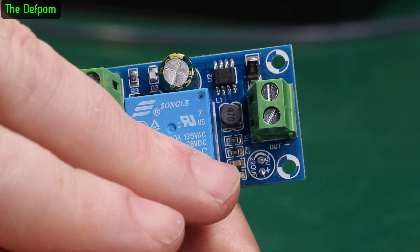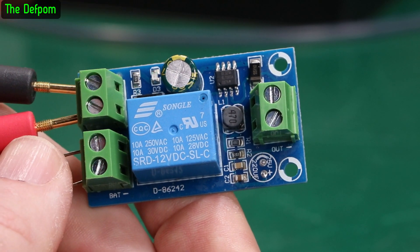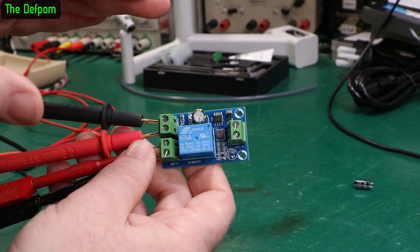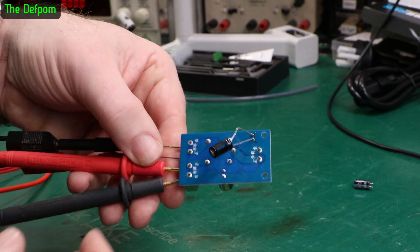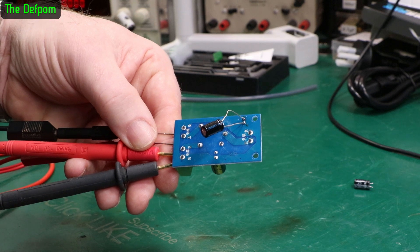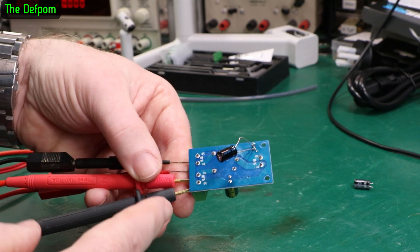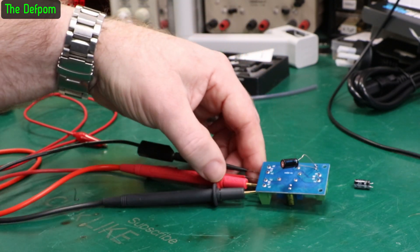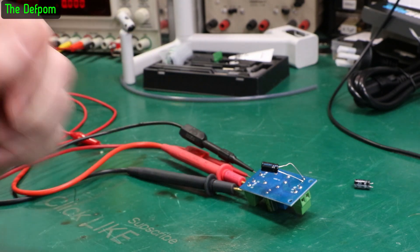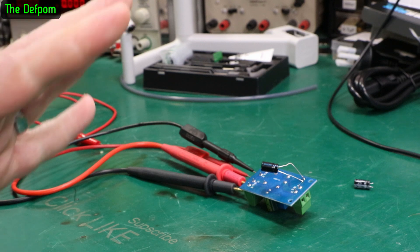What happens is that capacitor has got to discharge. So if that capacitor is taking too long to discharge, the relay coil takes longer to turn off because it's got a slope — the voltage will slope down. I can demonstrate that on the scope potentially. But what I've done is changed that capacitor to this one — this is temporary, I'm playing around. It's a 33 microfarad. So I've gone from a 220 down to 33. My original turn-off time was 100 milliseconds between changeover — between loss of power and changing onto the battery supply — and that was too long. 100 milliseconds might be okay in some circumstances, but I wanted a quicker switch. So I've modified it with this capacitor — simple modification.